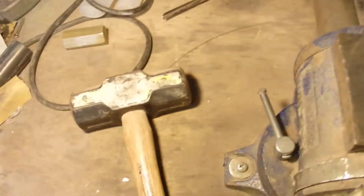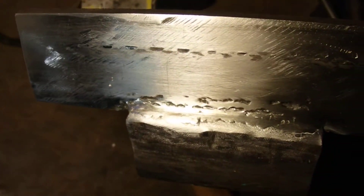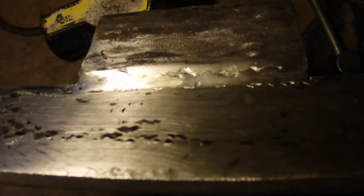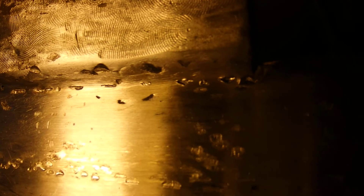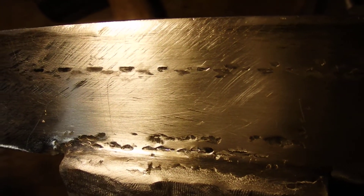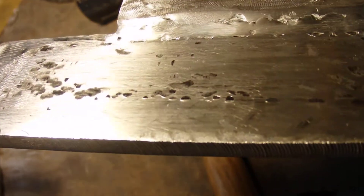Let's get a super close-up. I don't see any sign of that weld coming loose. You can see the lip of the bead, but it's not lifting off the metal — it's part of the metal. You can see the ripple-y edge of my weld now that the tube is flat. Those marks are from the vise, not undercut. Those little slanty eyeball shapes right there — that's the undercut, same on this side, about a quarter of an inch below it. You can see the hammer print marks all over it. Without a doubt, super strong weld. No problem.